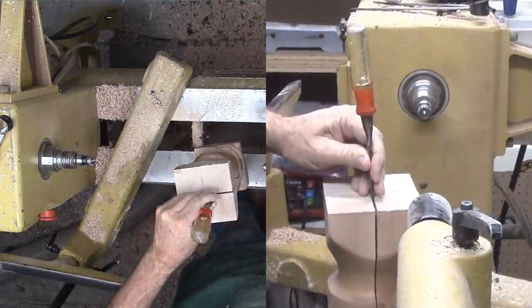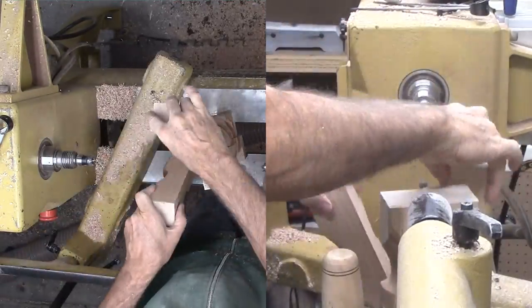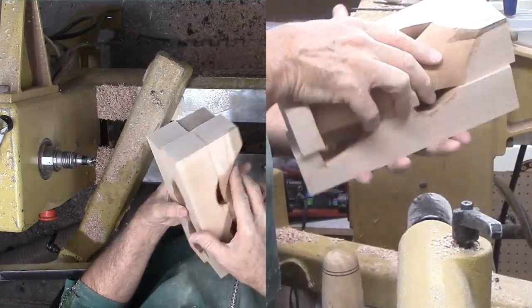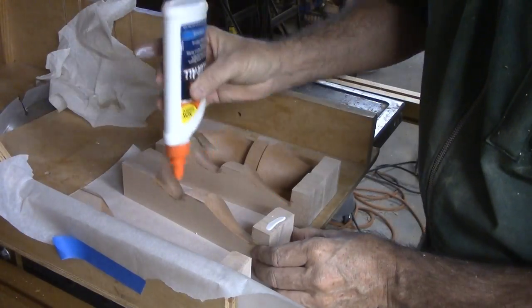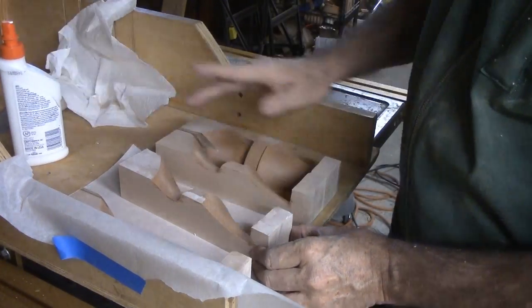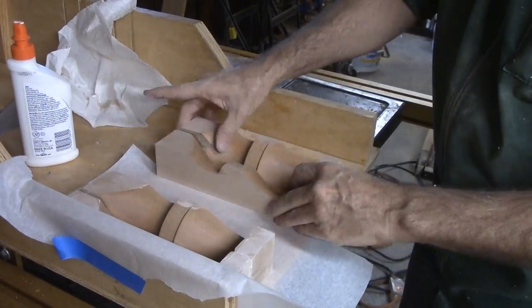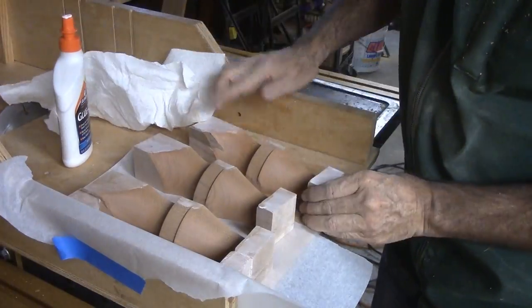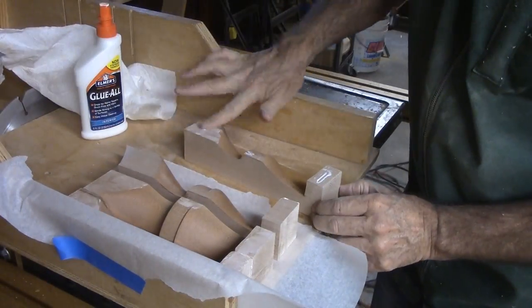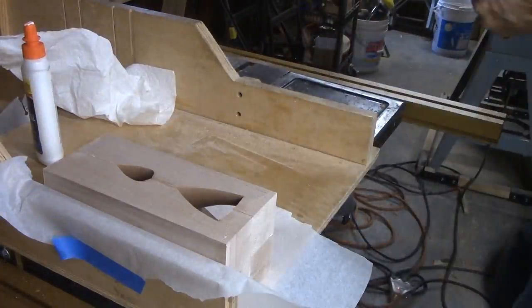After sawing off a half inch from both ends, the four pieces of wood come apart either by hand or with a gentle tap with a chisel and mallet. After a light sanding, I'm rotating each piece and gluing everything together again. This time, the entire flat surface gets a light coat of white glue. For this purpose, I like white glue because any squeeze out will be clear. I'll let it dry thoroughly overnight.